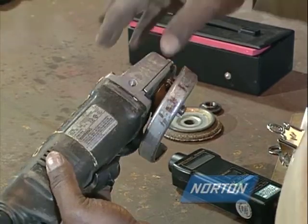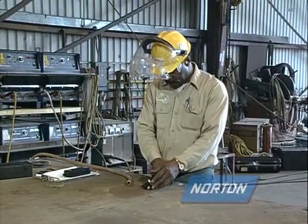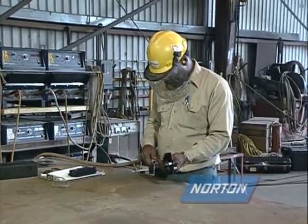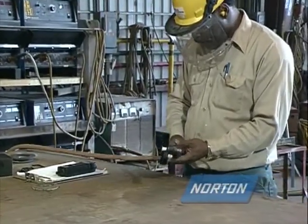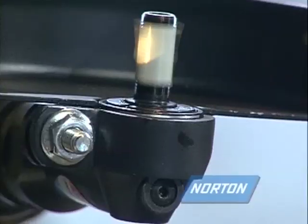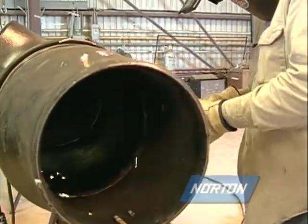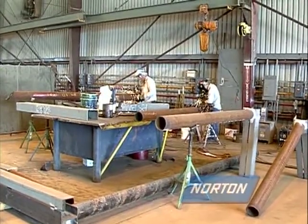Both electric and pneumatic grinders must be maintained on a regular basis. ANSI recommends that air-driven or pneumatic portable grinders be checked after 20 hours of use or once per week, whichever comes first. As with electric grinders, remove the wheel and loose objects from the spindle and apply reflective tape to the spindle. The proper air pressure on pneumatic machines is critical to your safety. If the machine is designed to operate at 90 psi, the air regulator at the workstation must be set to 90 psi or less. An improper setting could cause the machine to operate in an overspeed condition, putting the operator and bystanders at risk.